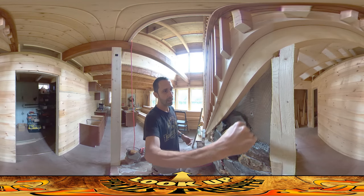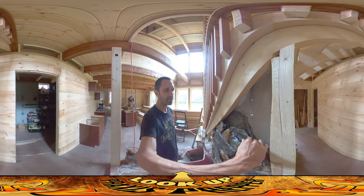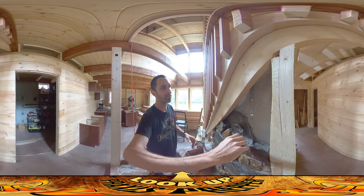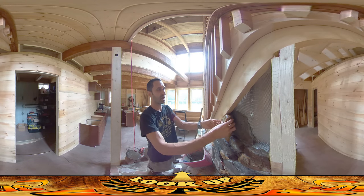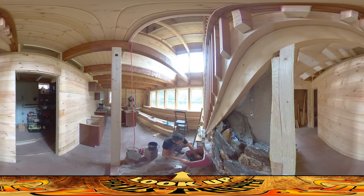The fact that I didn't have an issue doesn't mean one isn't possible — this is a small stone wall, only about my height. If you were going to do a larger application, maybe that would be a concern. What I do to make each run bond to the next is leave the top kind of rough. I'll put the stones in and won't completely fill in behind, so next time when I'm putting mortar in, it's grabbing the backs of those stones, kind of interlocking as they go up. The stone I'm putting in first I pre-position and pre-check to make sure it fits, then I get a little bit of cement in there and stir it around so it'll stick.